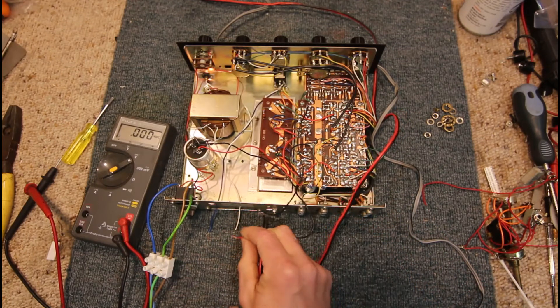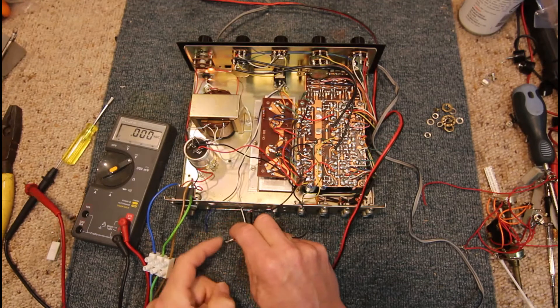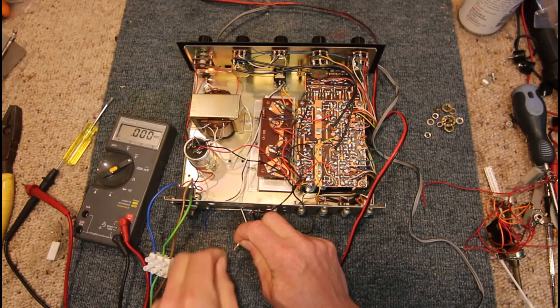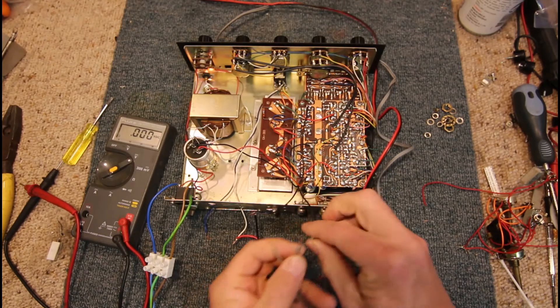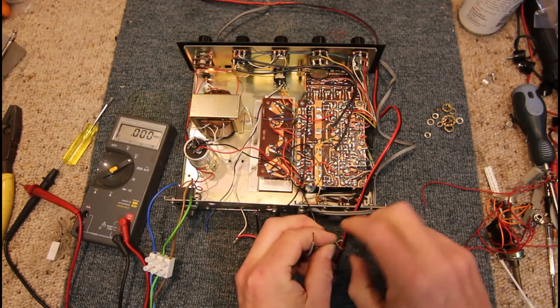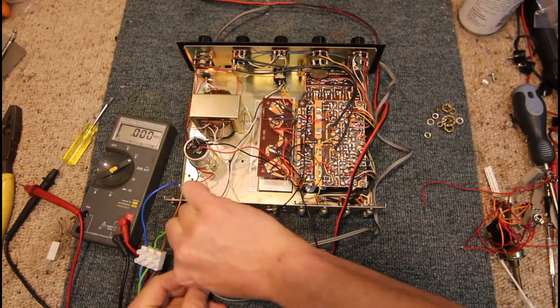Always got to be careful you don't short any of these wires to chassis, because the chassis will be ground. If you short your outputs, it probably doesn't matter with one of these old ones with a transformer and capacitor output — but with any of the newer amps, if you short the output to ground, you'll probably blow the output chip or transistors. Certainly for anything other than a brief short connection — yeah, some of them will blow instantly.